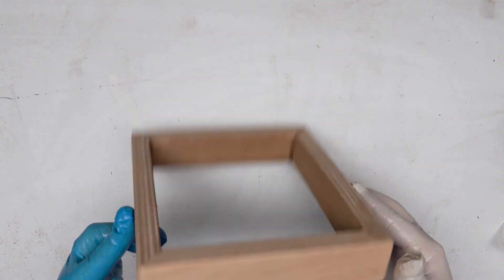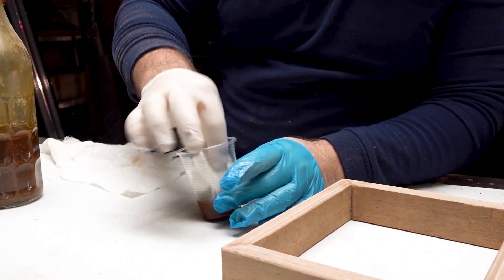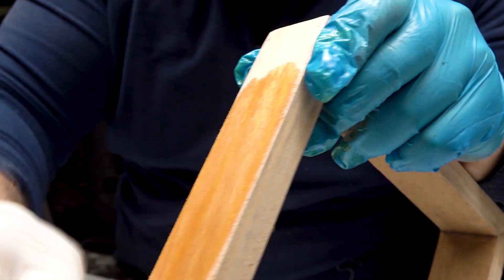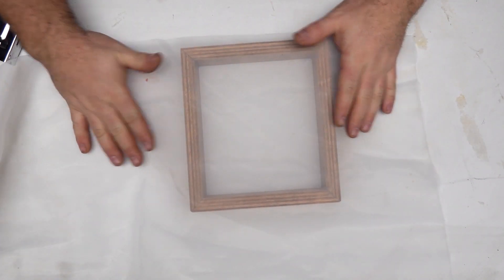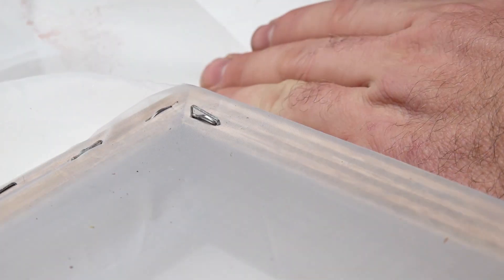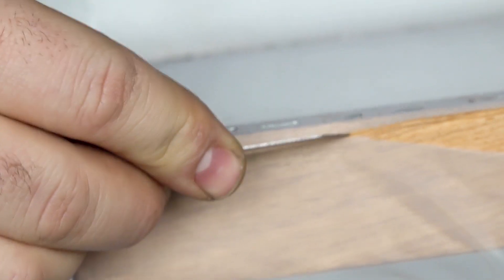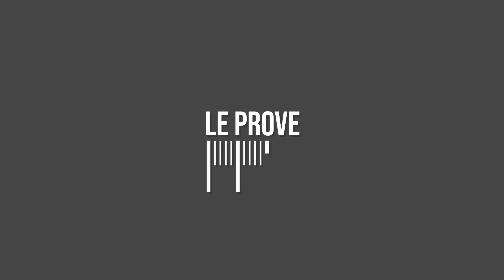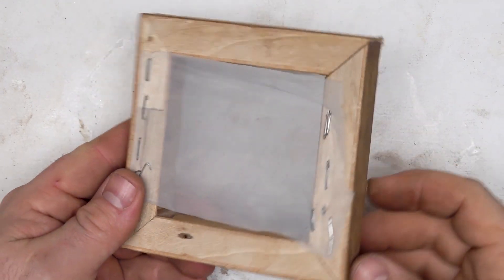The wood frame is very strong now. It's just a matter of waterproofing the wood, and to do this I'm using some shellac. I use some cotton and paste it very rapidly so the wood heats up and absorbs the shellac easier. Now I can put the fabric on top and secure it with a nail gun. I do this all around, and you can see now everything is so stretched it seems like a drum membrane. I can cut the excess of the fabric using a very sharp blade.